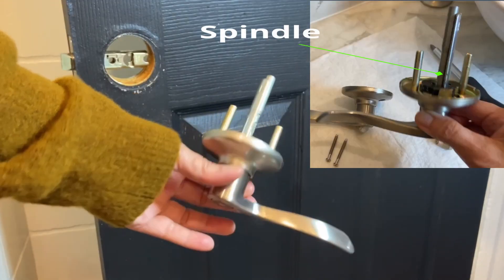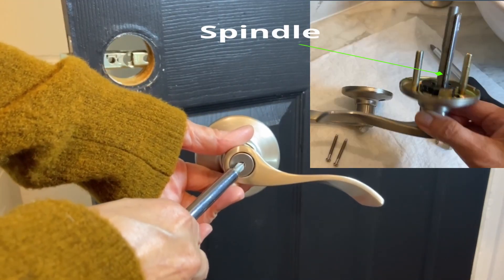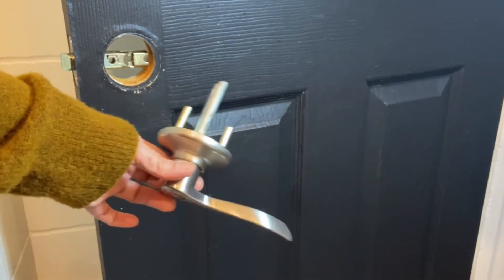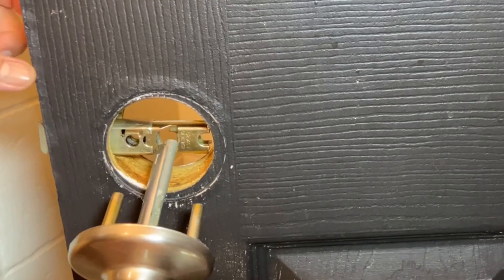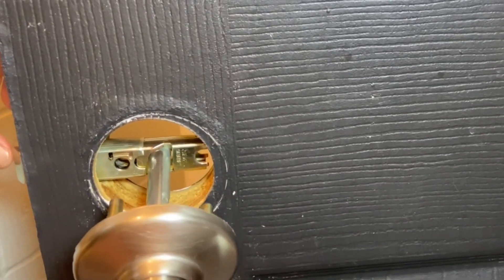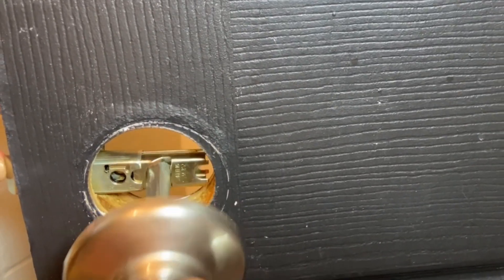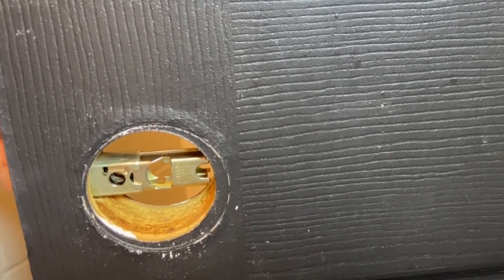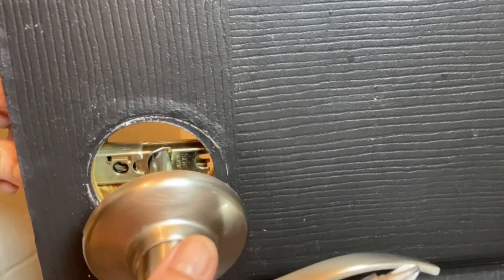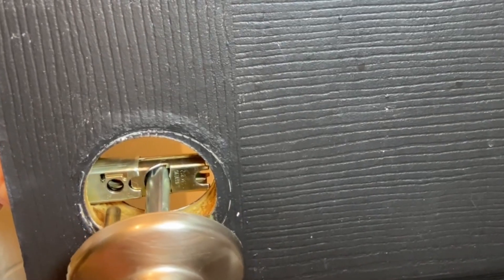This handle with a spindle goes to the outside of the room. Some locks have this tiny hole on the handle for unlocking from outside. If you just try to insert it through the hole, it won't work — as you can see, it won't fit. You need to press the bolt inwards to clear the opening, then you can line up the spindle and the tool mounting screw housing with the proper holes and feed them through.